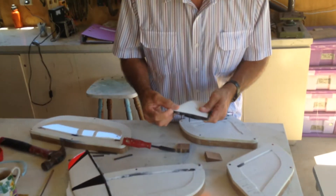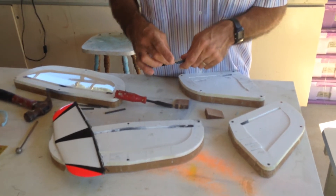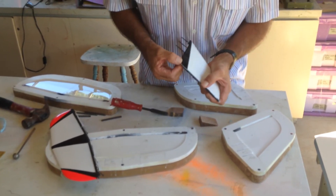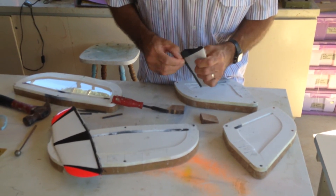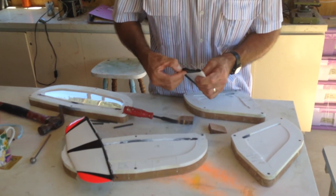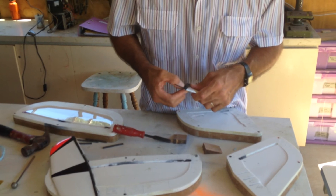If you feel this overflow here, this epoxy gel, it's not brittle and sharp and hard like normal laminating epoxy. So it's actually got a bit of softness, which will improve a bit over coming days. But because you're using it to join things that are so close together, it just doesn't seem to matter. And it's very, very adhesive — being a glue.